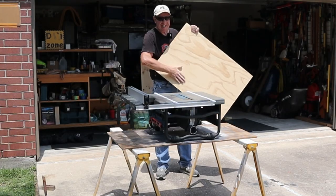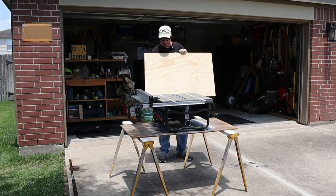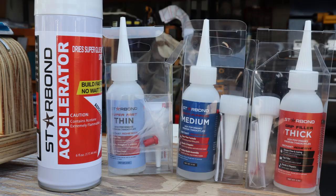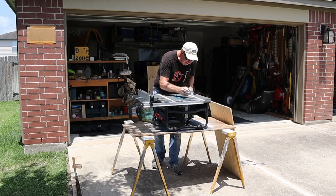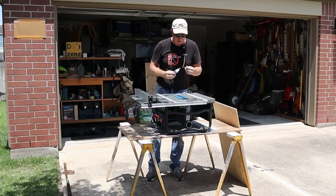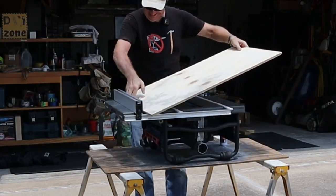I'm going to glue this down with the best side of the plywood facing down so it'll be the smoothest. I'm using Tight Bond — medium thick. Just need it to hold long enough till I can get it attached with some screws. I'll leave a link to everything I'm using. I take the activator and spray it, having already pre-marked where the tracks go. Next I'm gonna make the fences for the front and the back so they can be set up, clamped, and drying while I work on other things.